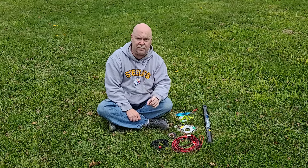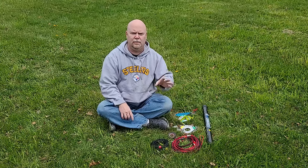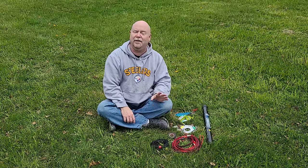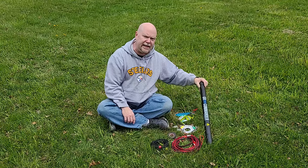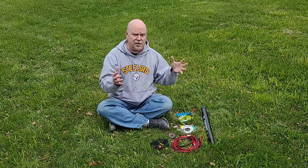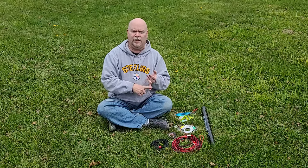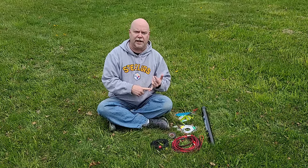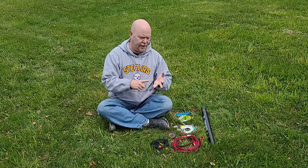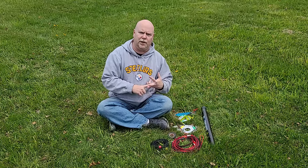If you need that because you're putting it on a motorcycle or in a backpack or six other things that I do that have no space, you really need the small pole and you should get the Expedition model. If you don't need that small collapsed pole size, get the Classic. The pole is going to go up faster because it's in fewer sections and the pole is stronger, and you'll have the option, maybe you don't need it portable, but you'll have the option of running more elements.